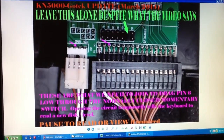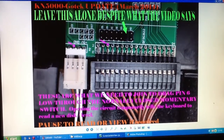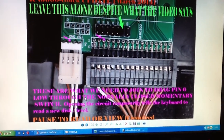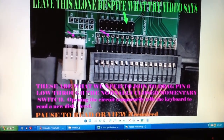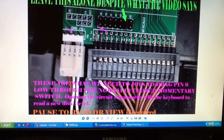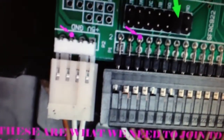Things are more simple than I initially indicated in the video. You do not need to interfere with the jumper as indicated by the green arrow — simply leave that alone. Only one loop is required, and that is from pin 6 as indicated with the purple dot on the right, to the ground pin on the left through a normally closed momentary switch. So only one circuit is necessary through the loop. You will therefore only need, in most cases, a single pole switch.